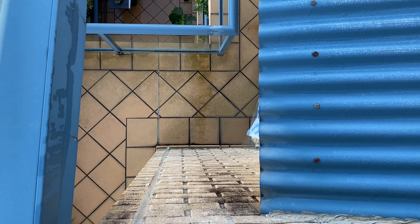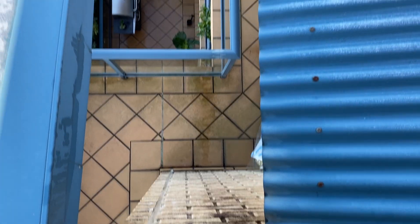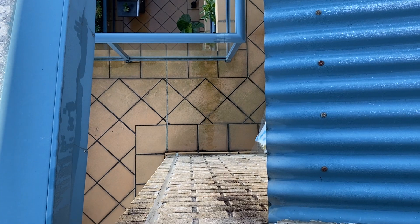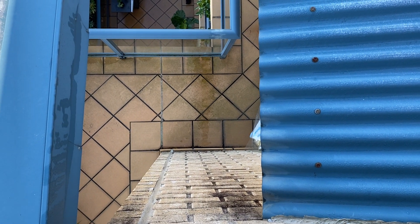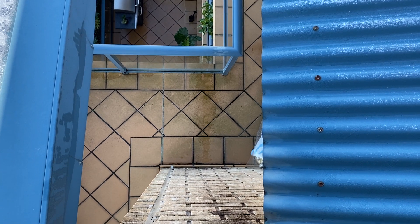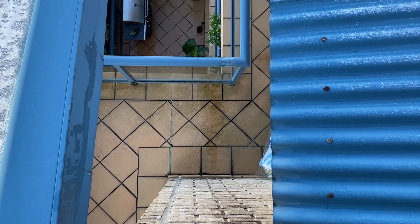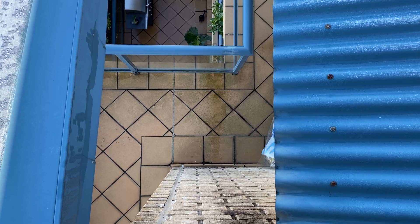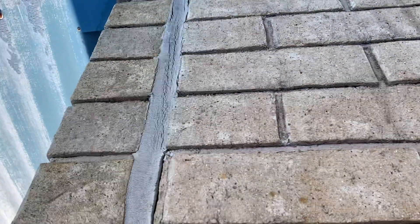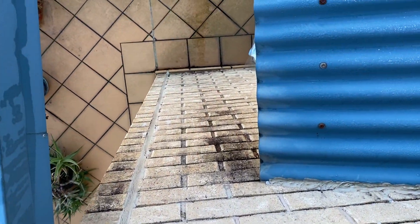The caulking needs resealing. There's also an expansion joint to unit 6 directly below that needs re-corking and sealing, and I'd try to re-seal these tiles in the first instance. So the first most pragmatic repair is to clean and seal those tiles to unit 6 directly below, re-cork the joint directly above the unit 4 water leak, re-cork this joint to unit 6's wall.